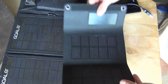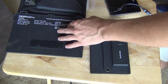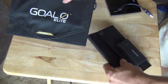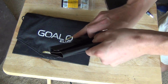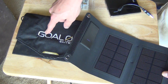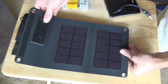This Instapark Mercury 4S is about the size of a 7 inch tablet. The Goal Zero is almost exactly the size of an 8.9 inch tablet, like the Kindle Fire HD 8.9. The Mercury outputs at 1 amp and has a maximum input of 800 milliamps to the internal battery. So 800 milliamps is actually higher input than the Goal Zero's USB output to begin with. Once it's stored in the battery, the battery puts out at 1 amp — so you're actually going to get a 1 amp charge out of this while you're using it.